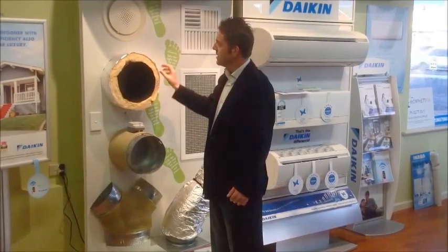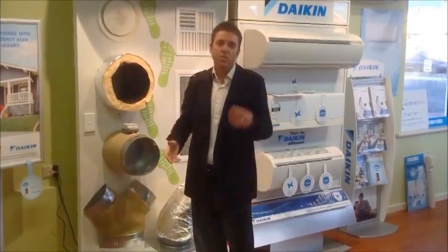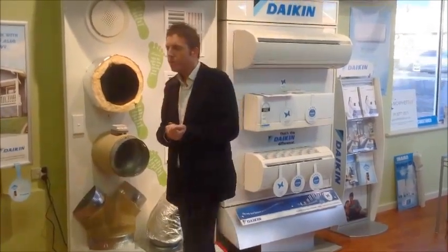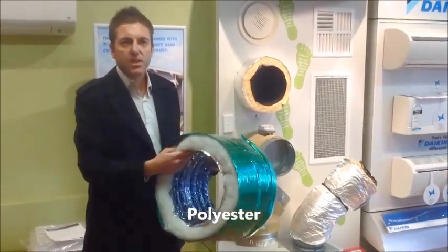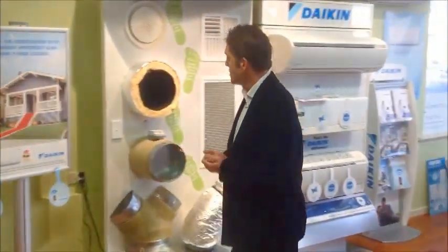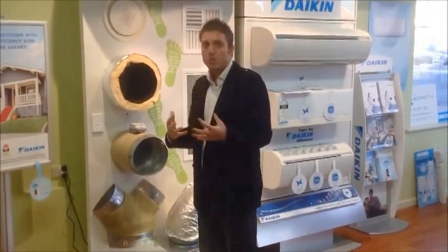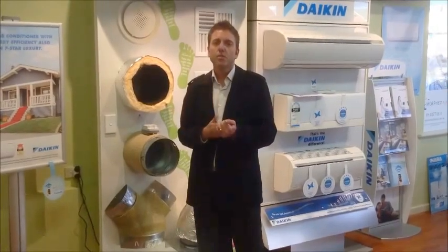This particular duct here is a fabric called rock wool or glass wool, which is the same sort of material as you'll find in your roof space, walls, and all that sort of stuff for insulation. The alternative type of insulation is a polyester, which is like a toned fabric, but serves the same purpose. The most important thing when looking at the thermal qualities is the thermal rating of the duct. Now they can vary considerably, from 0.6 up to 1.5 — there are even reports of 2.0. Making sure that thermal rating is as high as it can possibly be will help to minimise thermal gain and thermal loss, and therefore reduce your running costs.